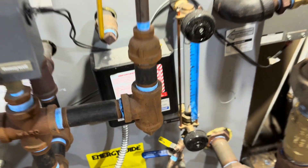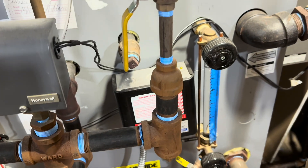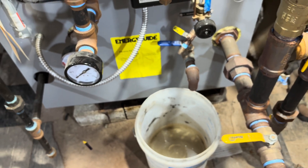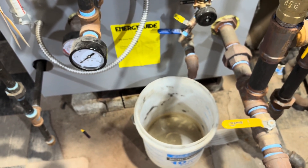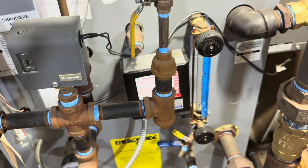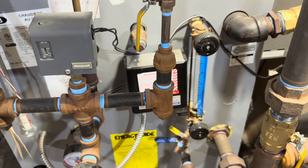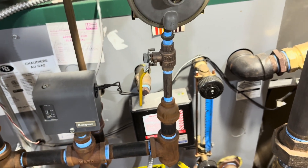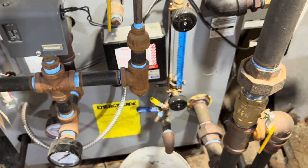What I'm going to do now is drain off some of this extra water. I might save it — it's pretty alkaline, so it's a little dangerous. You don't want anyone to drink it or get it on certain parts of your skin. But I might save it because it's so clean; I could add it back to the boiler as some water leaves during the normal heating season. I'll drain some of that off and start the boiler up. We'll see if once it starts boiling, any mud gets kicked up and settles back out. I'll repeat this drain and see if there's any mud in it.